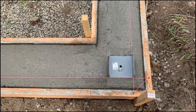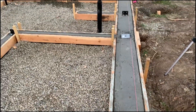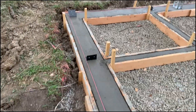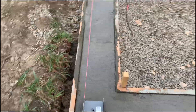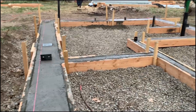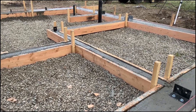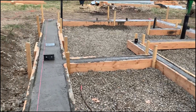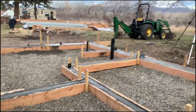The pour is complete. We used every last bit of daylight. As you can see by the survey string, all of our post anchors are well positioned, so we're ready for a timber frame. We'll let this set up overnight and most of tomorrow, then I'll pull forms in the afternoon and give it several days to cure before we stick anything on it. I still have some work to do on the timber frame but we're getting close.